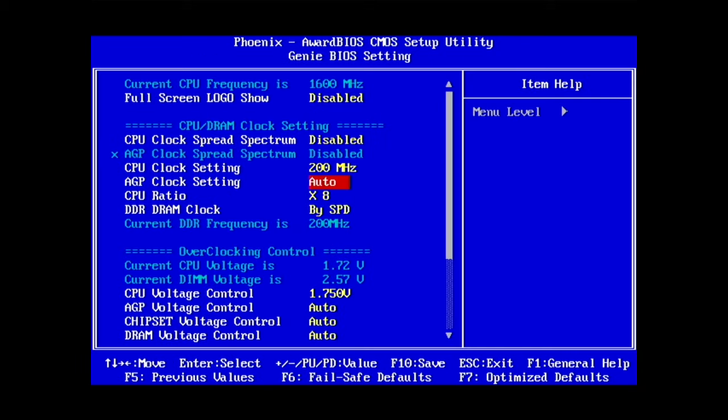So actually running effective bus of 400 MHz, and we can obviously overclock the RAM too. So I could technically hook up something and boot mem test off, but I'm not gonna bother. But this proves the point that you can now run a 400 MHz effective bus instead of 266. So we set in a clock frequency here, but we got double data rated bus on Athlons on the socket A platform, and the same thing with the slot A. The K7 uses a double data rated bus from Digital. It was licensed from their DEC Alpha line of CPUs. So yeah, this is working really nicely.